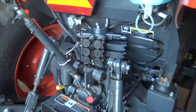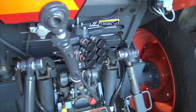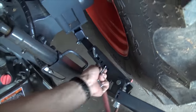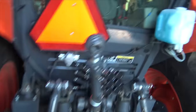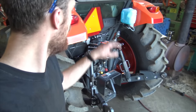All three valve stacks are now installed — two new ones added to the original — and I don't see any leaks anywhere. I think we got the cable setup pretty good and it's ready to hook up and use. I'm very happy with how well that turned out. I thought this was going to be a major struggle — I was afraid I'd have to take off an entire fender or big section of the cab. Really it's just three bolts replaced with three studs and the valve bodies added in.